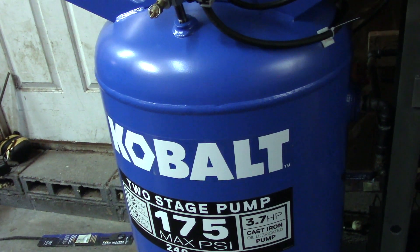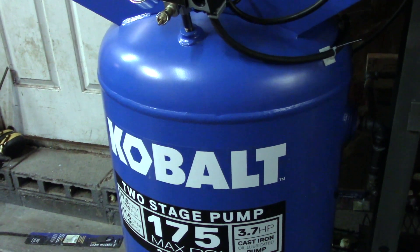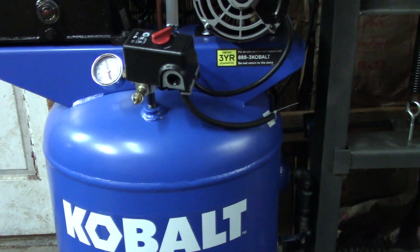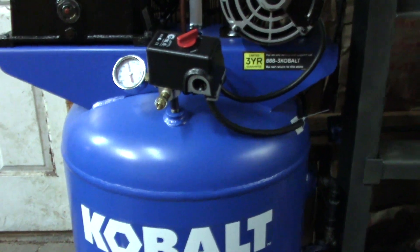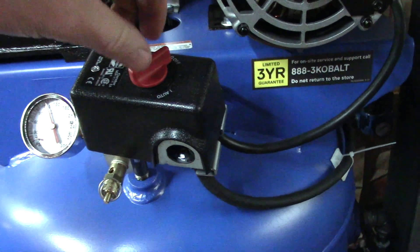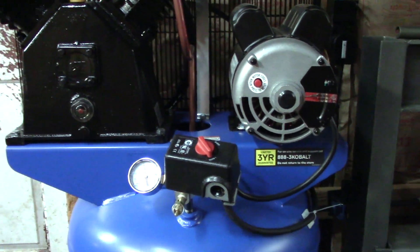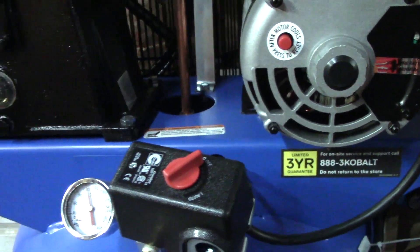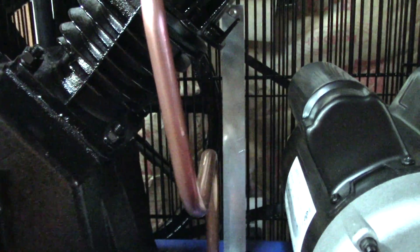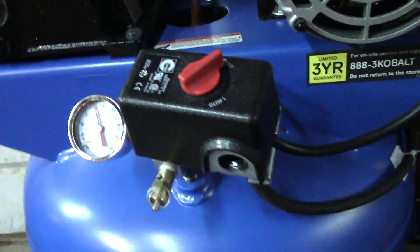I have this compressor in the garage, and when I'm in the house it sounds like a very faint helicopter in the distance — not annoying, but you can hear it. I'll turn it on and stand about three feet away; you can hear me talk over it. I'm keeping the run short out of respect for my neighbor. After I turned it off you heard the air release — the pressure switch releases air from the line so that when the compressor re-engages it's much easier to build momentum and start compression again.